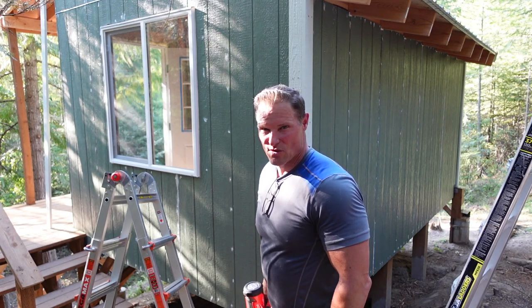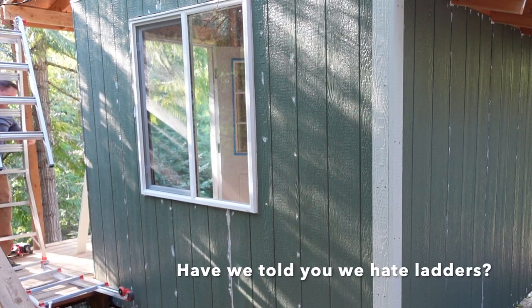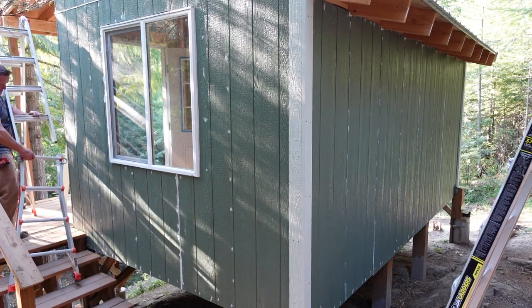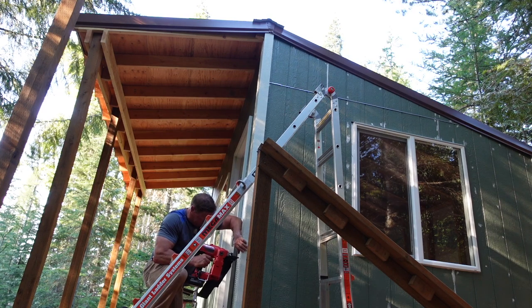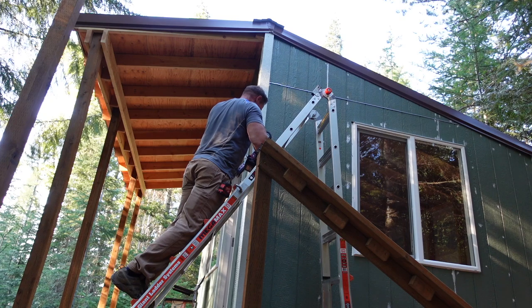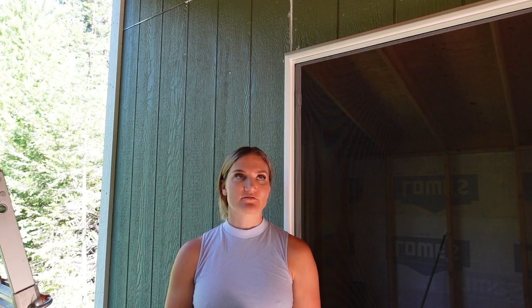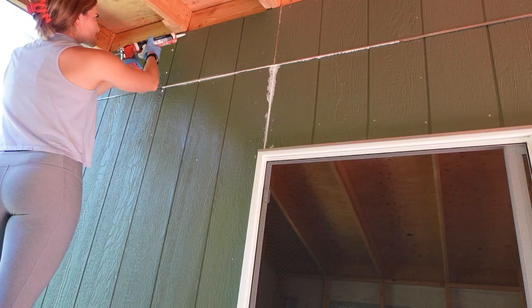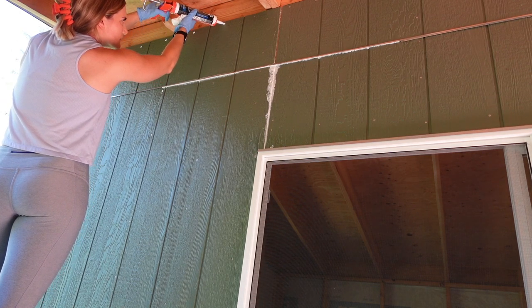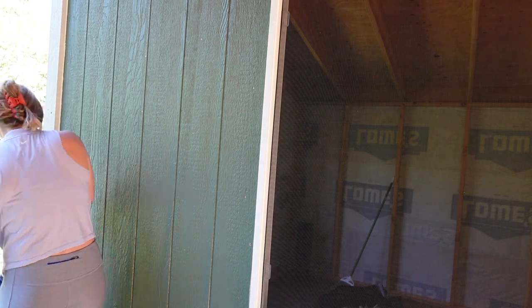Last corner — the entry corner off the deck. Starting on caulking the front side now while Rick does painting of the trim for this window. It's a very tedious process but it's much needed to protect from water damage. You've got to seal the caulk around the nail head edges so no water gets into the nail holes.